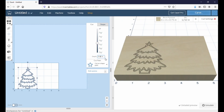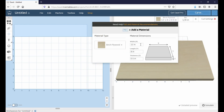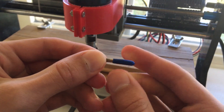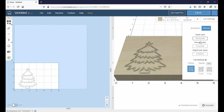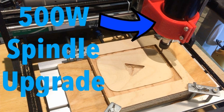Since this first cut will be doing more engraving on the surface rather than actual cutting, I'll set the cut depth to 1/16th of an inch deep. The material size and type can be set in the cut settings menu, and in the next menu the type of bit can be set. I will use one of these small vbits to engrave this part of the project; however, I will configure it as a normal 1/32nd bit in Easel. I usually use the default settings for feed rate and depth of cut, but because I have an upgraded 500 watt spindle, I can increase these values a little by selecting manual. I left a link to the 500 watt spindle upgrade video in the description below.